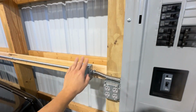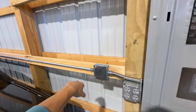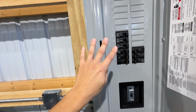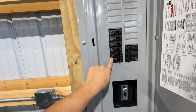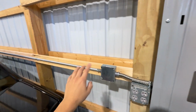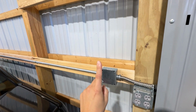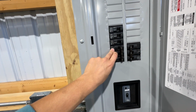And what this allows you to do is save some wire and save on some conduit, because instead of having to run 3 separate breakers, each with their own hot and neutral, for a total of 6 wires, where each of them would be counted as a current carrying conductor, you only have to run 3 hots and 1 neutral. Because with the multi-wire branch circuit, the neutral will actually only carry the imbalance between the 3 phases, and therefore you only need 1 neutral, because that neutral will never see more than 20 amps because it's only carrying the imbalance between the 3 phases.